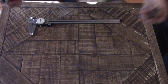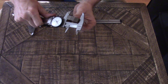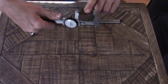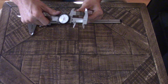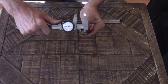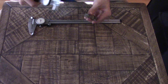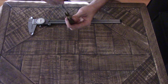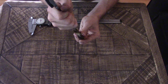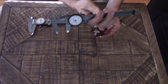To demonstrate: I've got a part here and I want to know the thickness. You grab your calipers and use your thumb wheel — most of them have a thumb wheel on the bottom — push it up and that's how you measure an outside diameter. To use the inside jaws, you turn it over and measure in between. You can rock your calipers slightly to get the most accurate reading. For the depth gauge, you extend your caliper out and plunge it down to touch, and that gives you your depth.